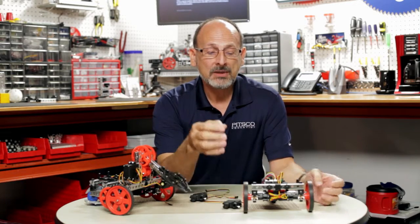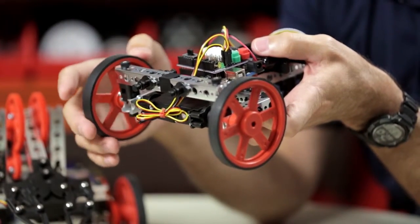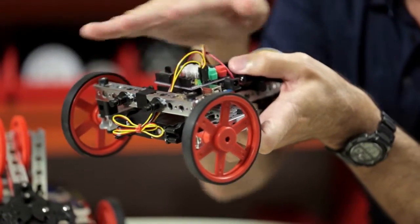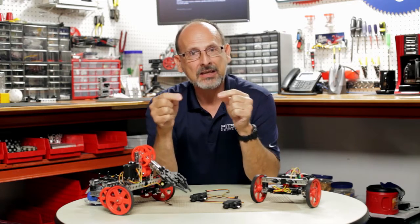The other way this becomes important is if I want my robot to drive straight. Because of slight variance between servos on each side, I might have to adjust my values so that when I give full speed from one side I get the same effect and my robot drives straight. I might not be able to give both sides the same command in order to get the robot to behave as expected. The more you understand how servos are reacting and what's causing that reaction, the better you'll be able to create a robot that performs the way you expect.